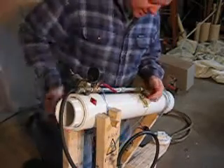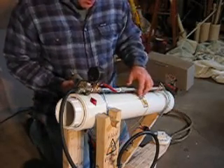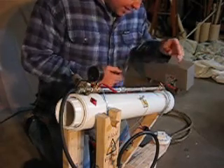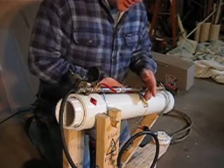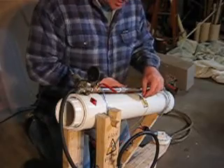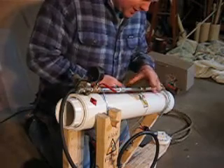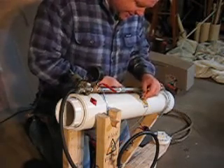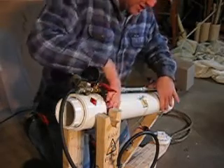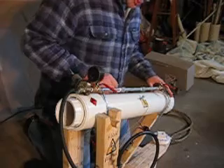For the electrodes, you see these here — just regular screws through the base with nuts so I can adjust them, tighten them, and adjust the spark gap inside the chamber. It is in the middle of the chamber, which is the weakest part, however I'm only using propane and not an oxygen mix, so it handles it just fine. I have it in the center because you get more bang if your spark is in the center — the flame goes both directions, burning in both directions for a bigger bang. If the spark is only on one side, you get a slower burn; it takes longer and only starts from one end.